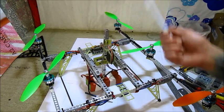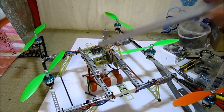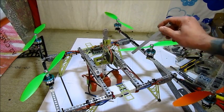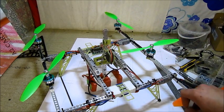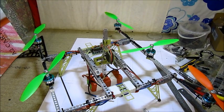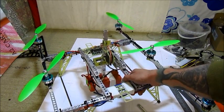I'm not sure how that's going to work, because on the KK2 board the cam stab activates only when the motors start to spin — when the throttle goes from idle. That's totally different, because you can check and do your settings while the motors are not spinning.